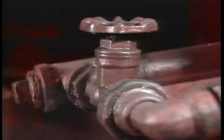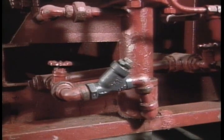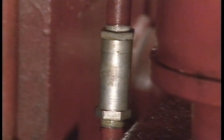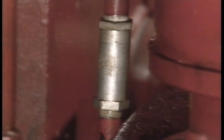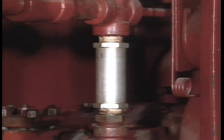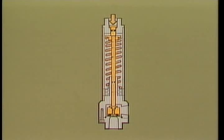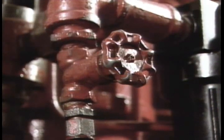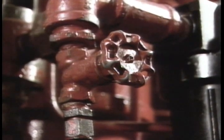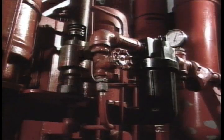Hydraulic fluid from the mix tank passes through the shutoff valve, through the suction strainer, and into the suction end of the hydraulic pump. Fluid leaving the pump passes through a check valve into the accumulator system — the check valve serves the same purpose as in the triplex pump system. When system pressure returns to normal, hydraulic pressure overcomes spring force and closes the pressure switch, stopping air delivery to the pump. Opening the bypass valve allows you to send air directly to the pump, increasing system pressure until you close the valve.